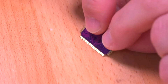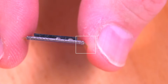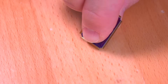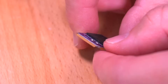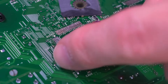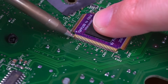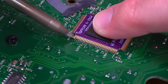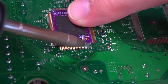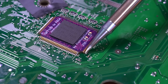We'll need to bend each of the four edges down so that they will be able to contact the pads on the motherboard. To do this, I use a flat surface like the tabletop and bend them down uniformly. This results in a uniform bend — though be careful not to make too aggressive a bend, as it needs to only be flush with the bottom of the chip. We can then proceed to soldering in the new module, ensuring it's properly oriented by aligning the dot on the motherboard with the triangle on the RAM module. Once all the pins are aligned, tack the chip in a few places so it doesn't move, then go ahead and fully solder it in place.